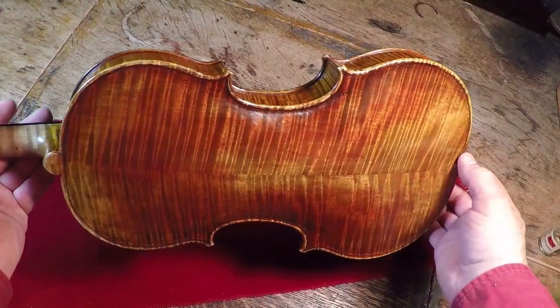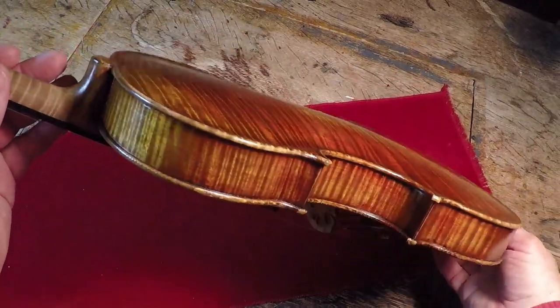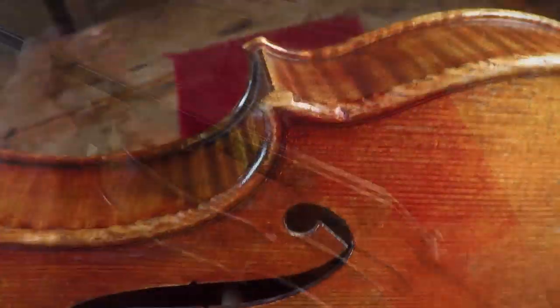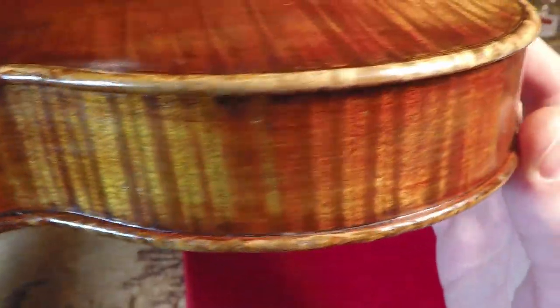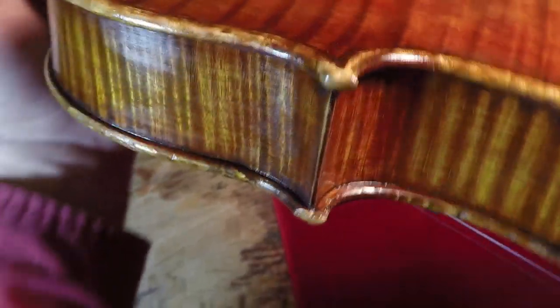You can touch things up as you go, or after you've finished the entire instrument. But if you do decide to go over the entire surface a second time, which usually isn't necessary, wait a few hours before you do. But don't get tempted to go over any touch-up varnish a third time, or the surface will almost always get rough. This technique has more effect than you might imagine, and it works on almost any clean instrument.